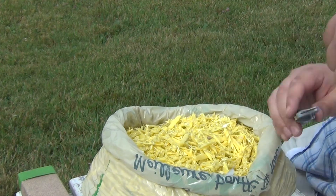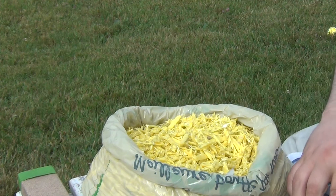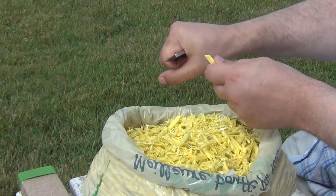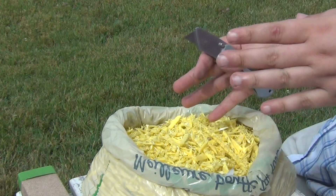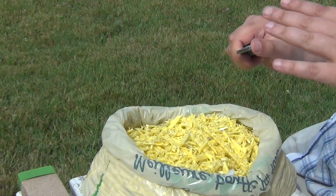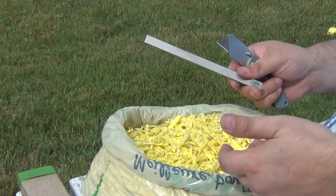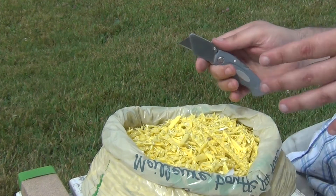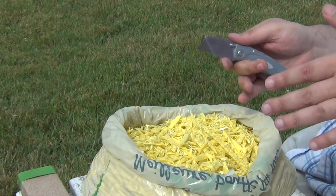The initial sharpness was lower with the cubic boron nitride rod finish — that wasn't surprising. I'm doing the push cut with almost no draw, just a straight push. Sharpness for push cutting is very different than sharpness for slicing; when you're sharpening for push cutting you want essentially the finest grit finish you can have. The cubic boron nitride rods have a relatively coarse finish, so sharpness on a push is relatively low. I expected that — it's always nice to actually do the experiment and confirm what you think.